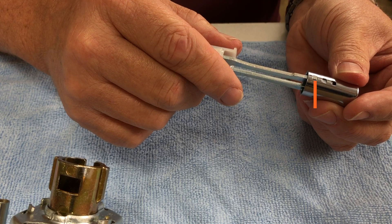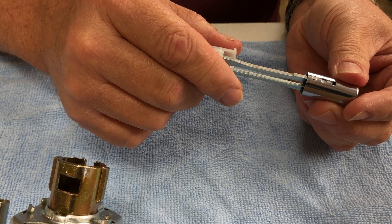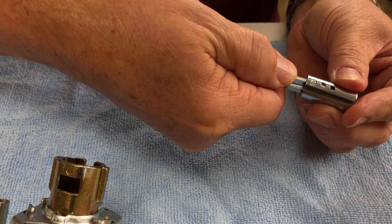The button is set at the factory for one and three quarter inch doors. The center slot is for one and a half or one and five eighths inch doors. The slot closest to the button end is for one and three eighths inch doors. If the button must be repositioned, press the two plunger shafts together and slide the button to the appropriate slot.